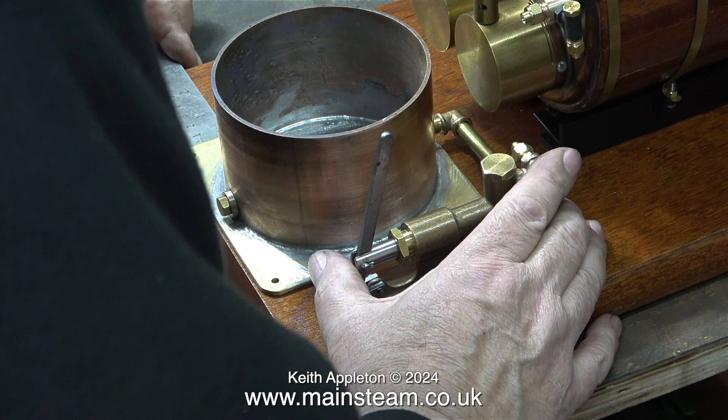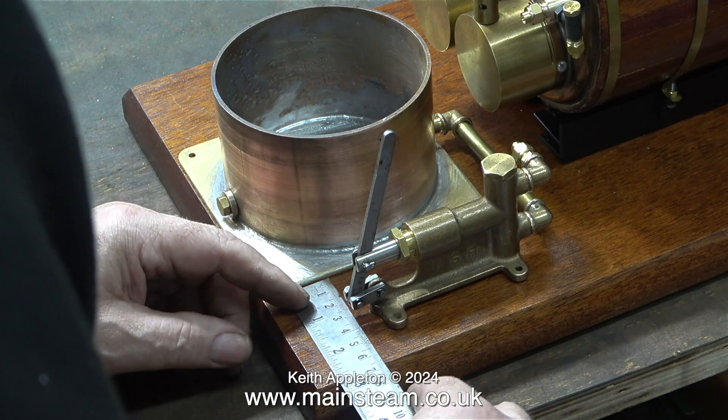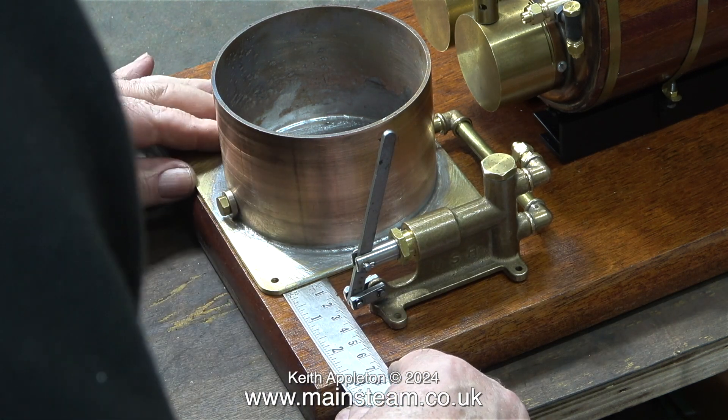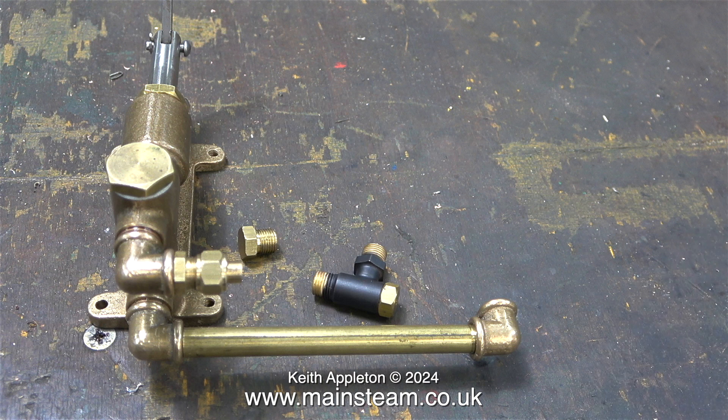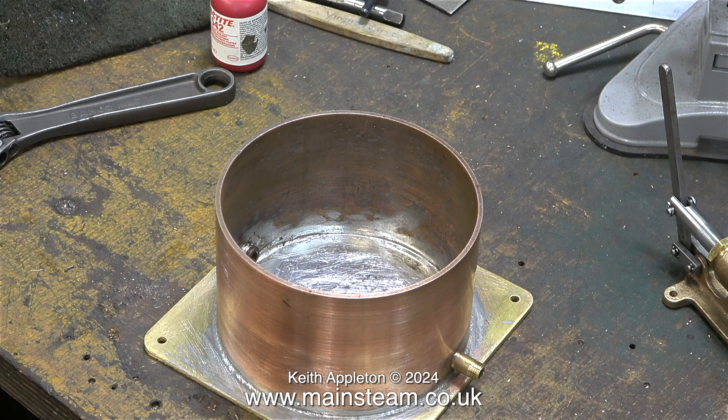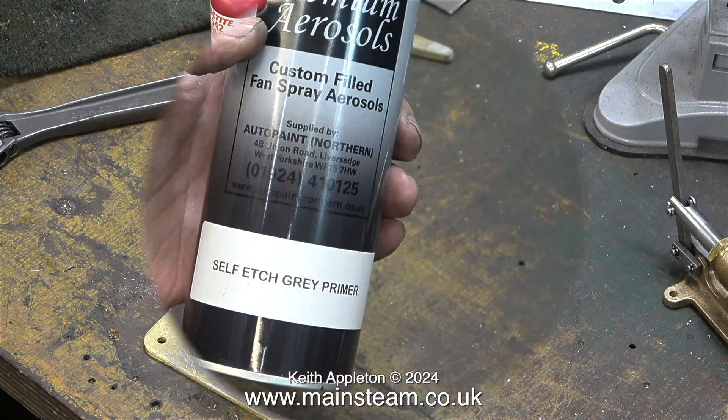In this clip I'm making some fine adjustments to the position just to make sure that everything lines up as it should, and measuring each side to make sure that the tank assembly is in the centre. Here are my kit of parts ready to fit to the tank. I'm going to complete the scouring of the tank to give it a key for the paint — I've also done the inside too.